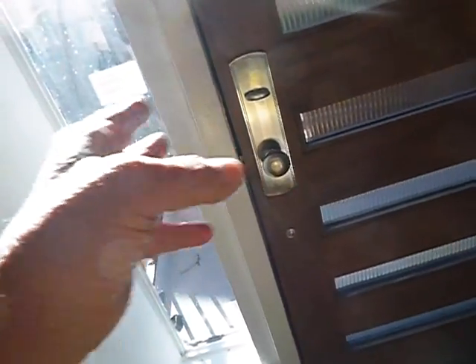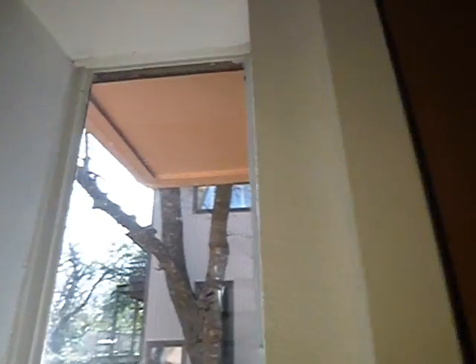Okay, windows. This window is probably closer than 24 inches to the door — this should have been tempered safety glass. I'm not seeing the label — I call them bugs — I don't see it. They can be hidden.